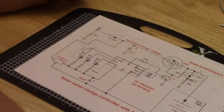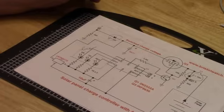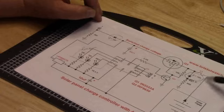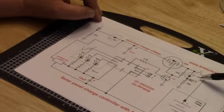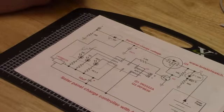I can't say whether I know more than this guy or not, but there's a few things I do know, and he and I had discussions over power regulation. Depends on your use case, really, but anyhow, he's got at least two Zener diodes in this circuit right here. It's set to 10 volts. The problem with Zener diodes is the voltage drop across it is not dependable. It changes with temperature and you can't trust it.